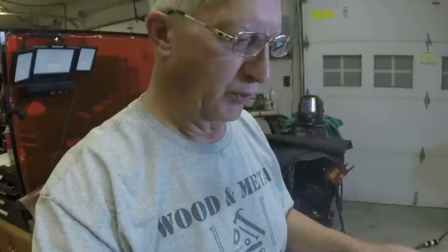All right, guys, that's it for this week. Got the power steering installed. So next step next week is focus on the choke and throttle cables and the wiring harness. We get those things put together, and at least we can start the engine, test out the steering, see if those repairs on the steering valve connections worked.